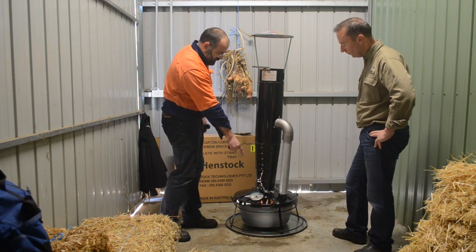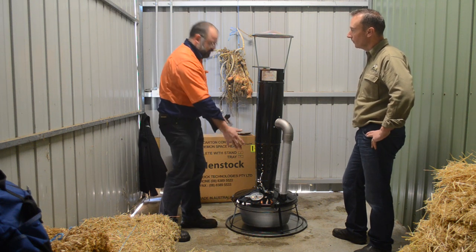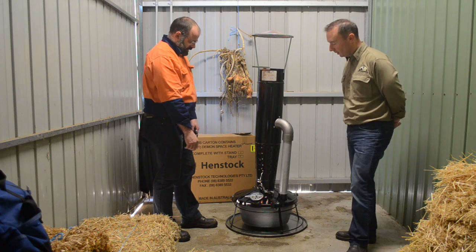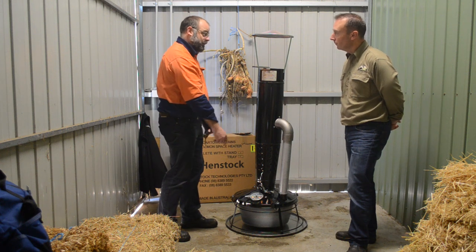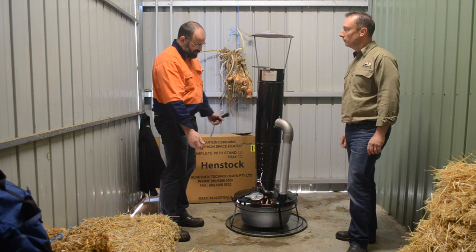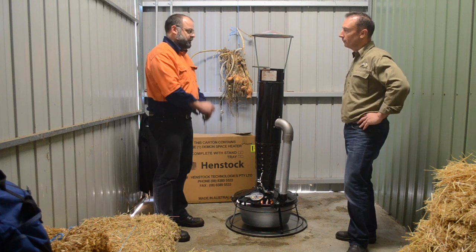You might have noticed the fire actually went out on the oil when I first closed it down — it kept burning up in the flue, and then it went back down on the oil. That'll happen particularly when it's new and it still hasn't sooted up. It's gone out again there now, and there are a couple of reasons for that: this isn't hot enough, we haven't been burning long enough. In your workshop you'd just be working on your machine, and 10 minutes later you'd walk over and close it down. We're doing it a bit quicker than normal. Of course it'll be a lot easier to light from warm — the next time it just lights so well.